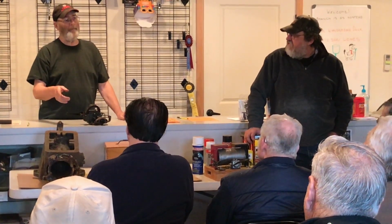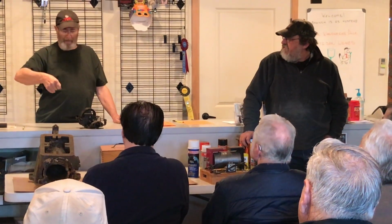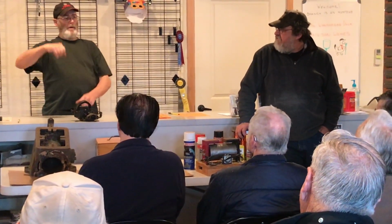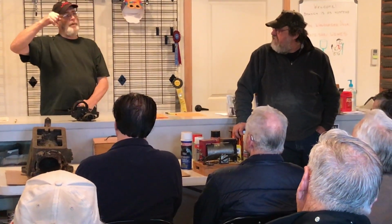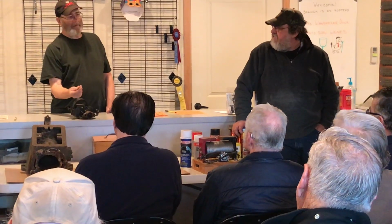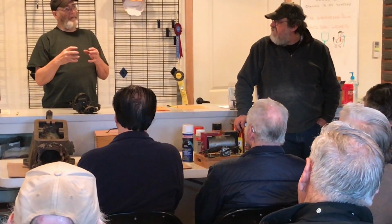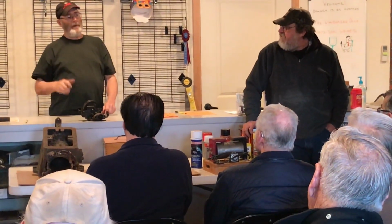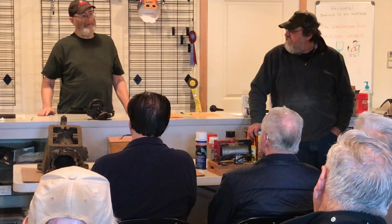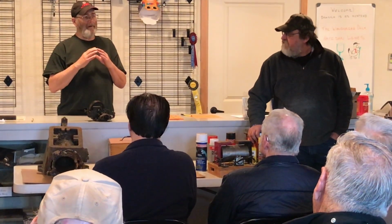Clyde pulled the top off the piston, ran a chain around the piston pin, got a hydraulic jack mounted up on there and started jacking on it and pulled the top off the piston. Well, then he could get down in there and get the ring off because it broke right in the area of the ring. He got the ring out, got the top out, welded it all back together, and it's a running engine. But you have to be very careful on a blind cylinder.